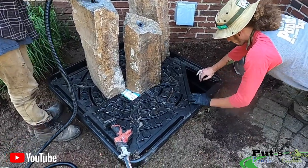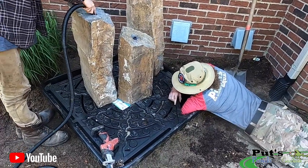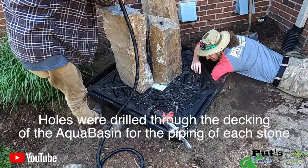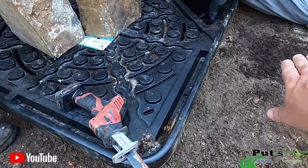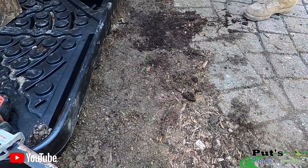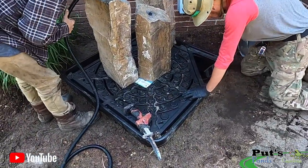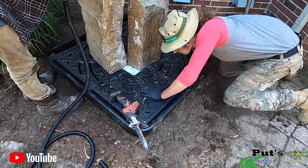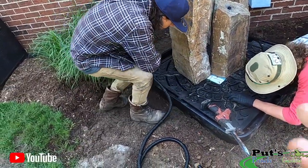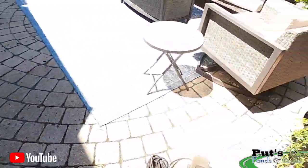We're running the piping right now, going with three-quarter inch and we'll switch to one inch if needed. I don't want too much water because we have no room to do a bib liner for over-splash. A bib liner would be a liner outside of the basin that slopes back down, but because we have a fixed point with our patio, we don't have the option of going higher with the surrounding soils. We are doing a retaining wall but can't do a bib liner, so we want to contain all the water and not have it splash over onto our pump.